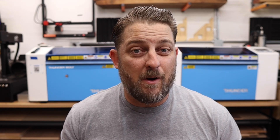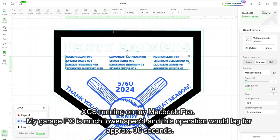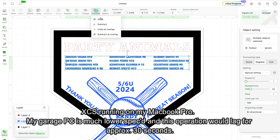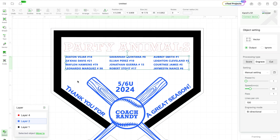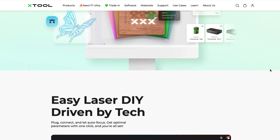XCS also requires a bit more computing power than Lightburn does, so I found it to lag quite a bit on my system when using it for design work. Things like the Union tool were slow to respond, so I found myself going back to Lightburn to do my design work, then importing it into XCS, using the Union tool to group areas together so it would engrave fast, setting speed and power parameters, and then running the job — which was not really an ideal workflow. At the time I'm recording this video, XCS 2.0 is currently in public beta testing and has a lot of improvements, but I'm just not familiar with it, so I can't really speak on it. All my experience is with XCS version 1.7.